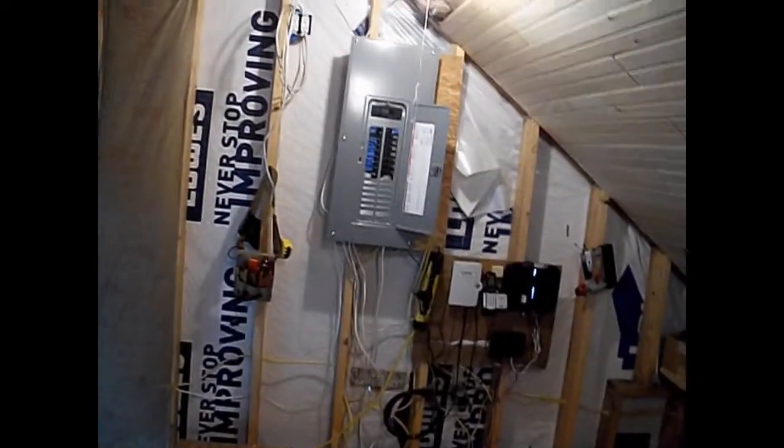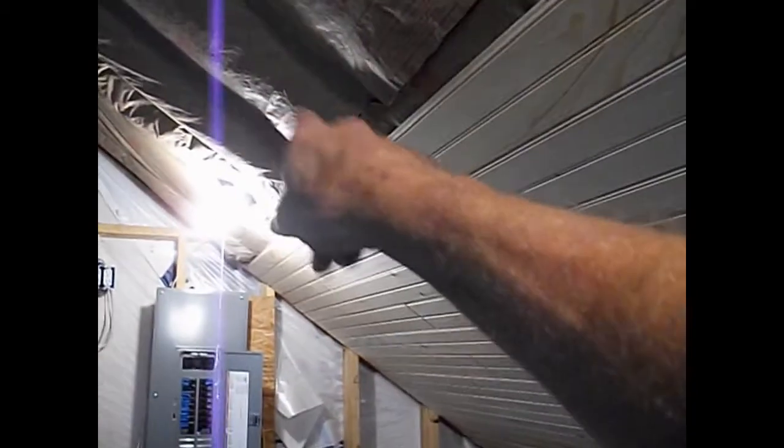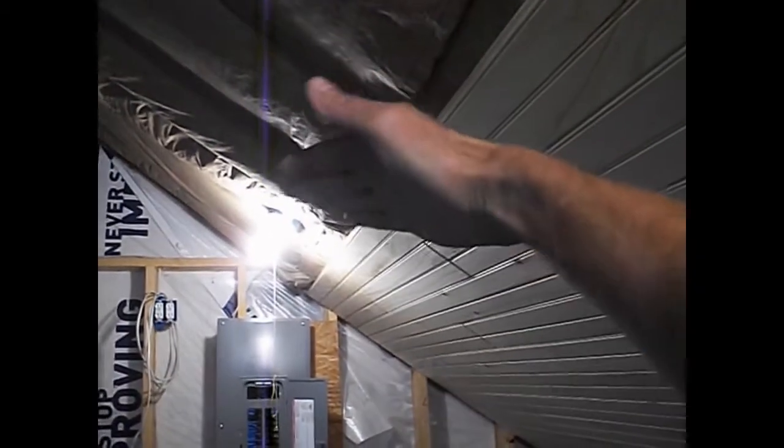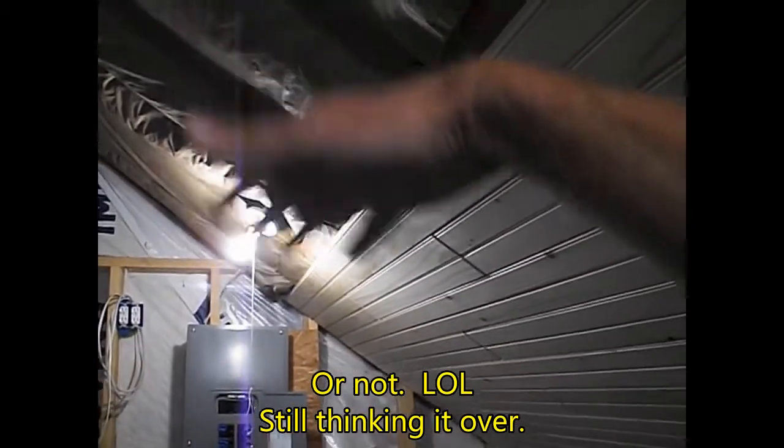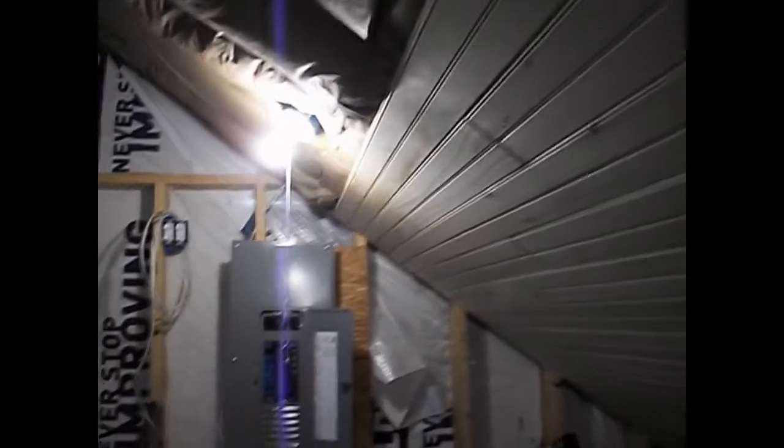I will do what I can on this side over here. Because I'm on the floor for probably another 6 courses, I can cut around these electrical boxes, which I'm going to pull and tilt them down so that I'll put them on a wedge so that the light will actually be horizontal, or the box will be horizontal, the light will be vertical. I'll do that with all three.